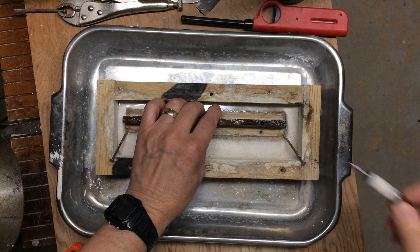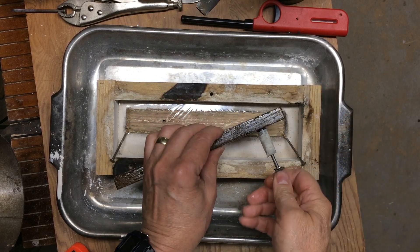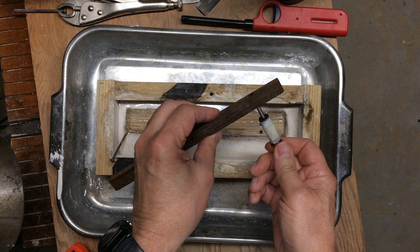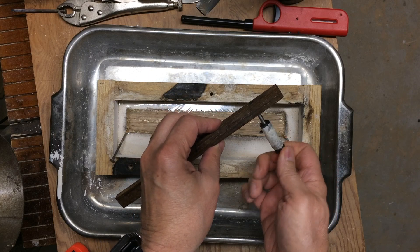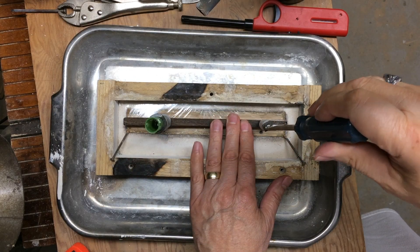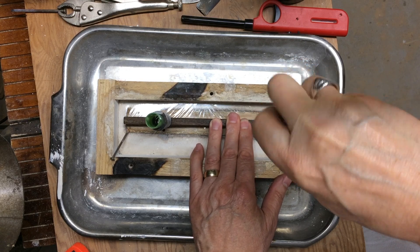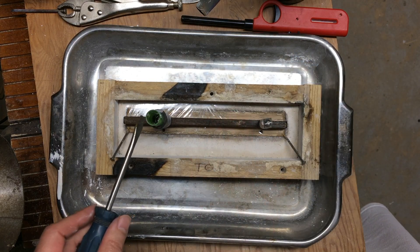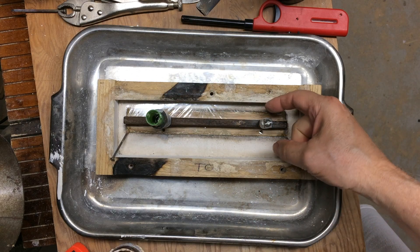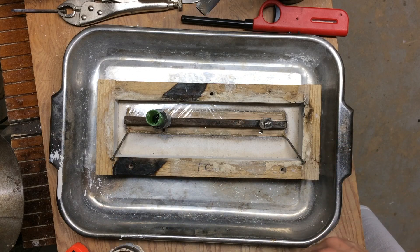The top part is really a throwaway piece. We're going to put that on. First we soak it in water, and the reason we soak them in water is so the wood pattern will expand, and as the mold dries the wood will shrink and make it easy to remove. I'm going to put these fasteners in here. So this will be the pour hole, and we'll put the pour cup over the pour hole to act like a funnel. This will be the vent hole, and these little nail holes will be the vents that will let the air escape as the hot metal goes in.